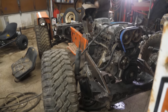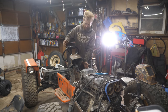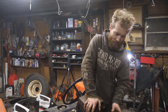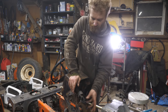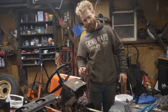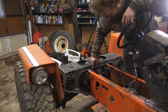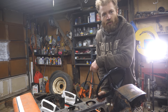It's pretty easy to steer considering the power steering isn't hooked up yet and it's sitting still, so that's good news. There's obviously more to be done with this console - close in these holes, close in the front, tie it in with the hood - all of that will happen later. In the future, this will also be a good spot to hide stuff like the ECU for the engine and little bits of electronics and doodads. We've just got a few more reinforcements to do to make this thing mostly rigid - mainly the back section here, which is really just welded on each side. I'm going to add in some braces and supports.